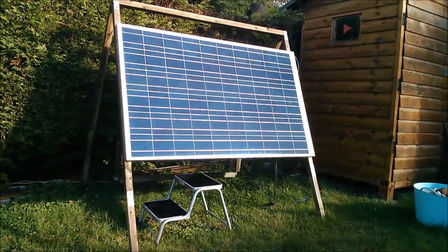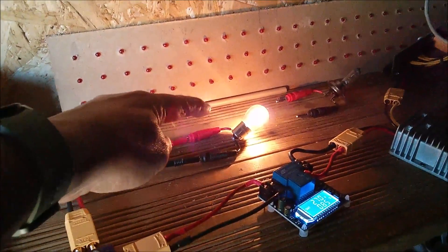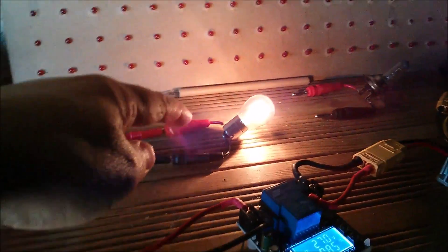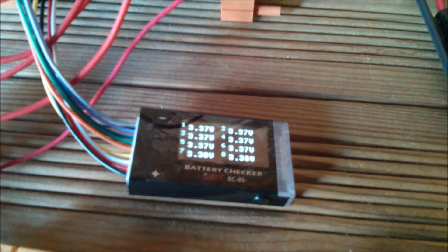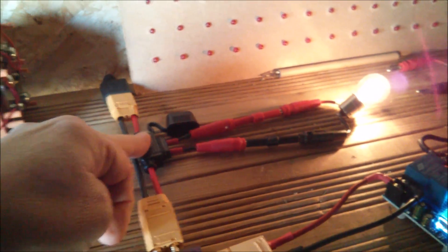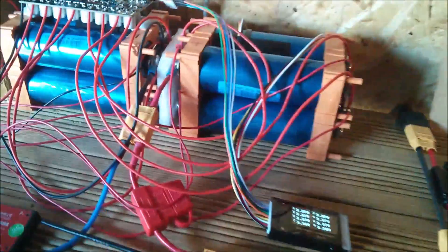Out in the shed — there's a solar panel with sun on it, as indicated by my sun indicator. The current is 1.28 amps. This smaller bulb acts as about a 1.2-amp current limiter, which is quite effective, so the cells will be charging more slowly than without the bulb. I need the bulb for now because there's a solar charging issue I'll have to come back to another time.